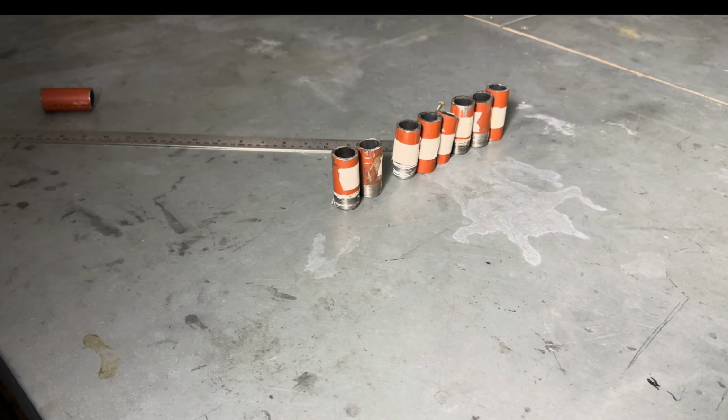So folks, if you were doing low carbon steel day in, day out, you're probably using an electric tool or even this adjustable low carbon steel pipe cutter. Okay, this would be more useful because it will give a straight cut. So let's put it in the vise. Leaves a big burr on the inside.